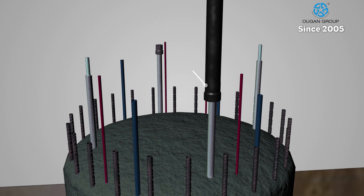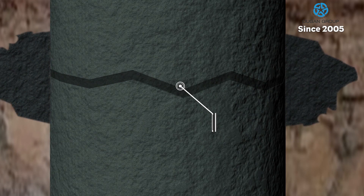If the pile tested is to be a working pile, then the void created during testing by the pile displacement can be filled by pressure grouting through the tell-tale tubes upon completion of the test. The upper pile element will be good for uplift resistance while the complete pile will be good for vertical compression.